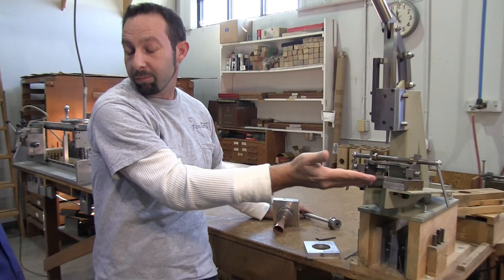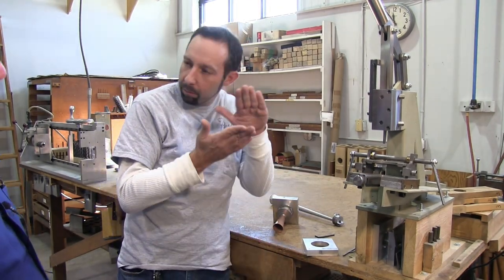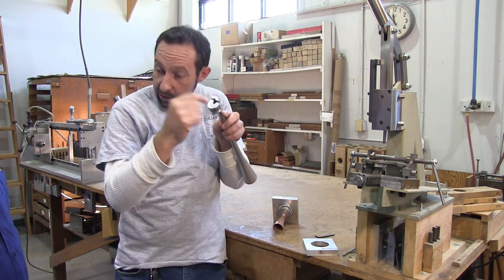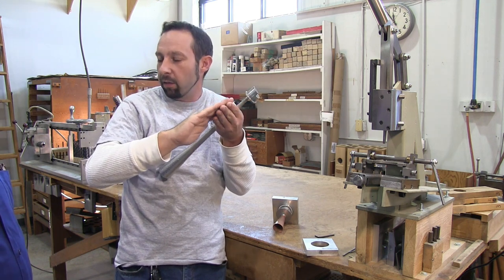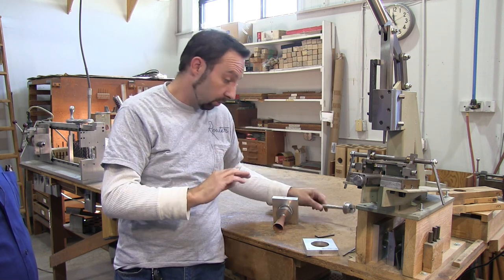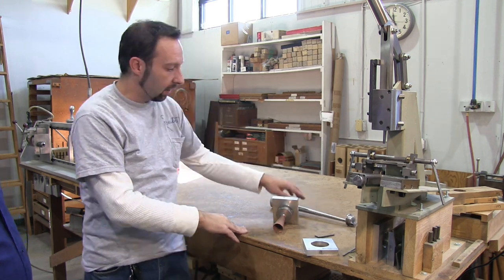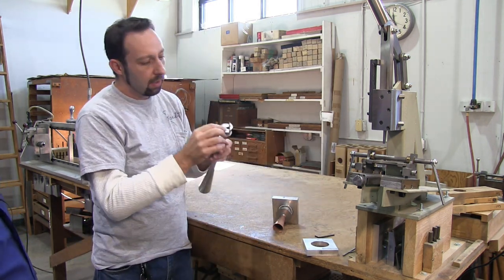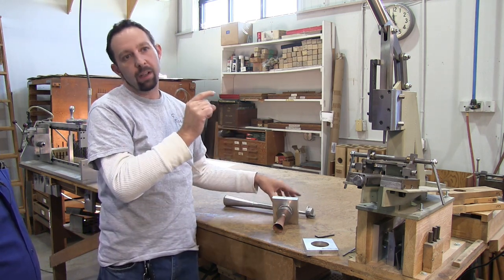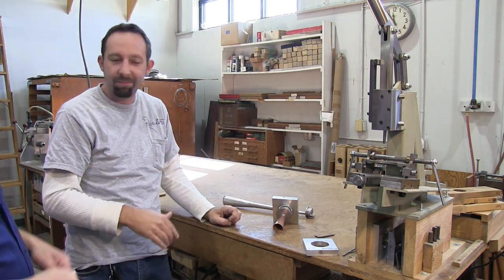And so we use wooden wedges here. But we're looking for the face of the wedge where it meets right here. When it's pounded in, you want to see most of it covered with the gray from the lead. And that'll tell you that it's snug and secure. So if you take it out, you can see that it rubbed and it's completely marked. Exactly. And then we cut a little notch in the wedge. We have a gauge over there. That way you know where it's set in at, and that's also your removal, so you can pry it out when you need to take it apart.